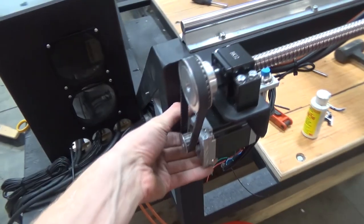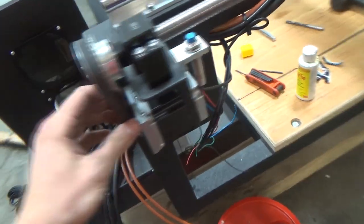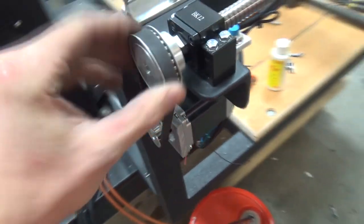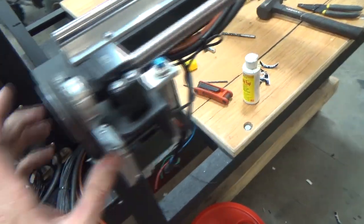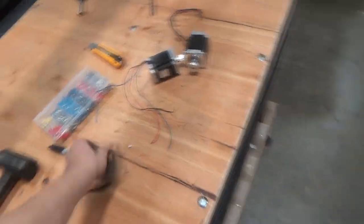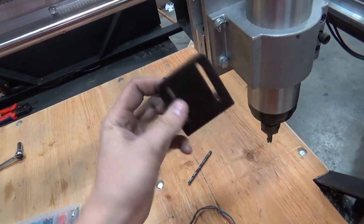But anyways, I'm gonna use the two I built for the two on the back. Got the belts up, zinging tight. They don't have a real great tensioning mechanism except for just putting the belt on when it's a bit too far. I think it's gonna work just fine. But anyways, I'm gonna work on the two other axes with the mounts that I got off the internet. But we're gonna do some shimming and some sort of tightening mechanism, so we're gonna see.